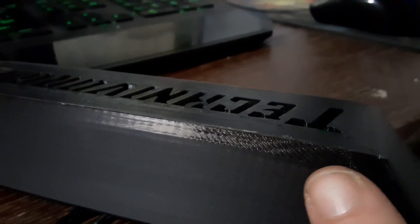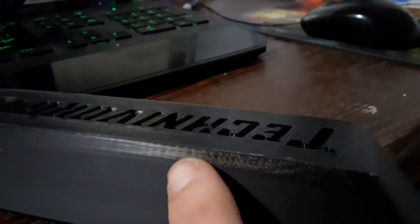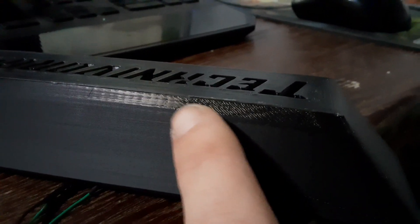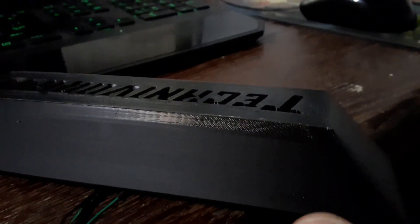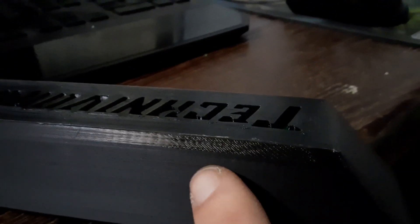But as nice as this turned out at 300% speed there was a bit of a defect. This is the bottom surface — because this was on my build plate — and you can see here some heavy vibrational ringing. I could hear it when it was getting to this point in the model; you could hear it scraping across there and hear the vibration. That stopped after a little ways up and it only affects this one spot. If I had done a better job leveling my bed — I feel like this corner was a little bit high — and if I had adjusted it properly I wouldn't have this artifact. I did level it but obviously it wasn't perfect because it was just this one corner that was sticking up and causing that scraping and vibration.